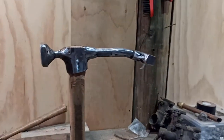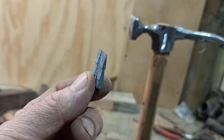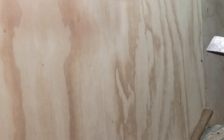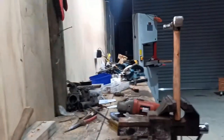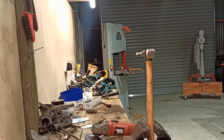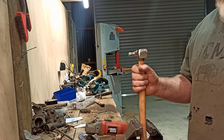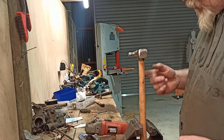So I've got one wedge here, like a proper wedge for a hammer, and I'll just make another couple tomorrow. So I'll bang this one here, and I'll have to make a slightly smaller one for this. There's something about that size for this might be alright too. See, this being fairly hard, I just have to be careful it doesn't split or anything silly. But it should be alright. I'm going to bang this one in, and then I might sand these, something a bit smoother, then give them a burn off and then give them another sand.